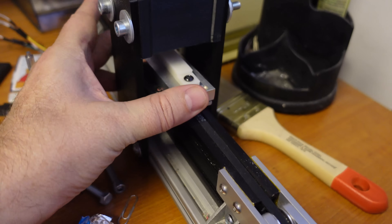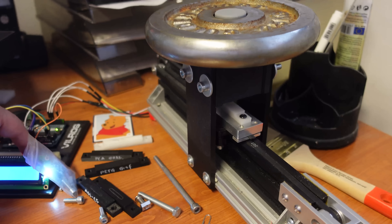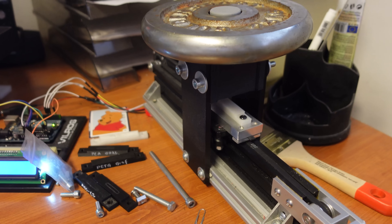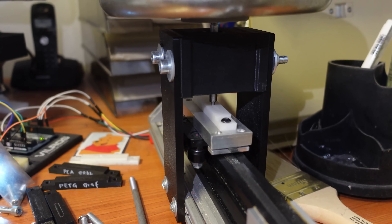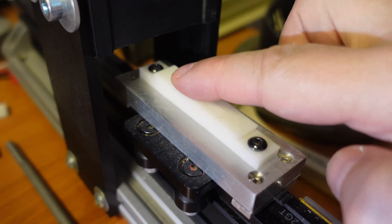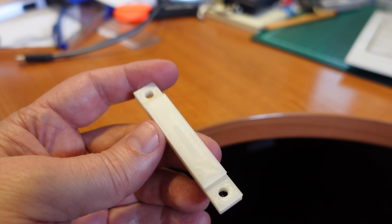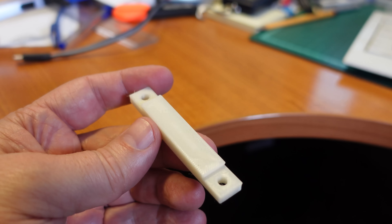Let's start with testing. First is the wear test: the shaft diameter is 3mm, the load is 2.5kg, and it will have 200 repeats. The wear was not measurable, so this TPU, like all others I've tested, is a very wear-resistant material.